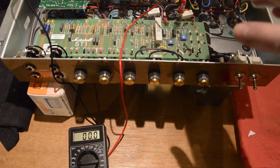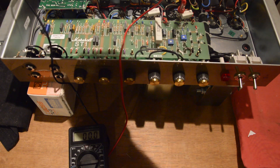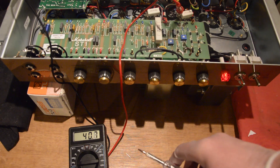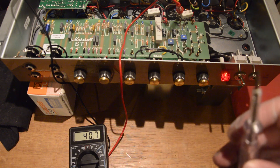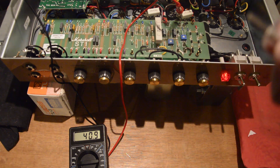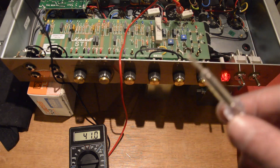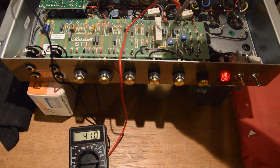I have the red probe connected to the right pin and the black one connected to ground. Now let's turn on this amp. After letting it run for a while, we're idling at about 40 millivolts, which means 40 milliamperes. The value you want is anywhere from 30 to 50 — the sweet spot is about 35, for me it's 40, but you're really good anywhere between 25 and 50.